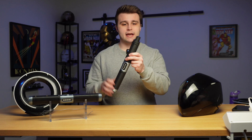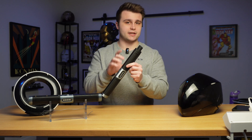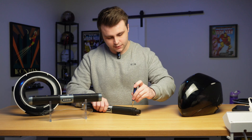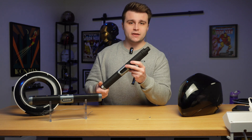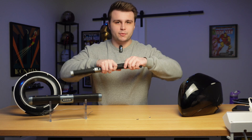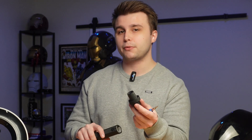We can start at the very end of the light baton. There are two screws on either side that basically sandwich the three layers together — you have the sound chamber itself, the outer black portion of the light baton, and the rails that everything attaches to. All the screws I'm using in this are M3 screws, except for the grub screws which I'm using to grip into the lightsaber blade — those are M4 screws. With those two screws removed, we can just remove this part of the sound chamber. For the sound chamber, I'm actually using two threaded inserts on either side for the M3 screws, which just helps with the overall strength of the light baton.